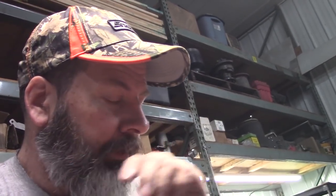And this machine, they suck the air through, just like an engine. But we opted to take it off the machine and clean it out. You know, guys out in the woods pressure wash them and all that good stuff, but just watch. I think he spent a good hour just cleaning, and we used fin coil cleaner for AC units, and the filth and dirt. And hopefully with any luck, that cures the problem.